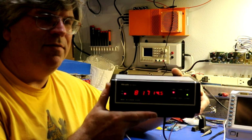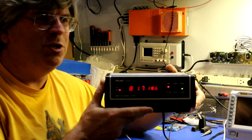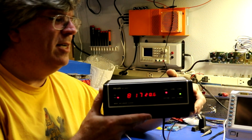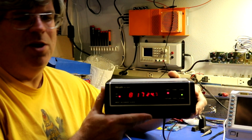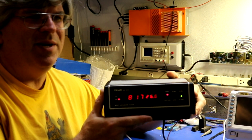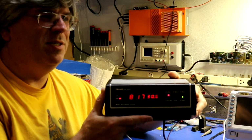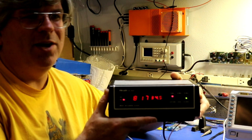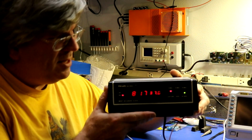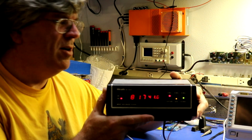Anyway, the next half of this video is going to talk about the repairs that I had to do to clock number 2. Now, as received, it wouldn't really tune 15 megahertz at all. There was kind of a very light hiss. On 10 megahertz, there was some static noise, but really no tones. 5 megahertz kind of came in, but the capture and data lights never lit up on 5 megahertz.